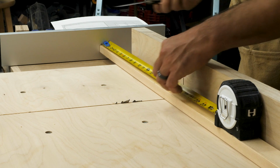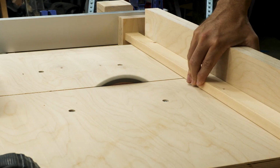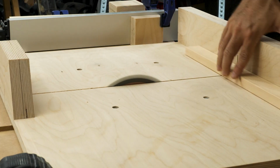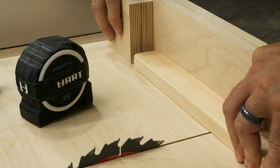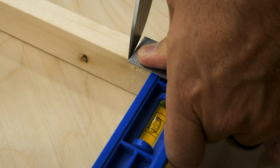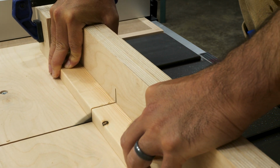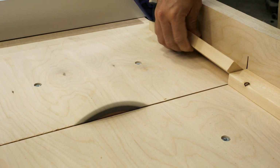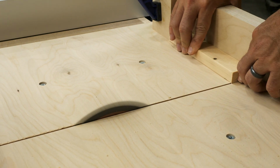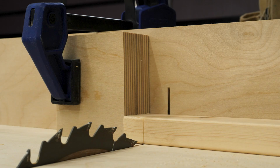The first thing I did was cut the 1x2 to size, 14 inches for the legs and 7.5 inches for the crossbars. To make the 14-inch cuts, I used a block against the fence for reference. I cut the 4 legs and then clamped a block to the sled to make my cuts for the 2 crossbars. This time around I used my knife to mark the wood. I learned this from watching Jonathan Katz-Moses. By doing this, I could make sure that I was getting a very precise cut with the sled. I can just slide the piece forward until the carbide tip of the blade rests perfectly into the groove I cut with my knife, and it worked really well.